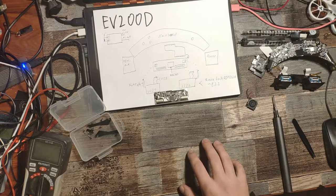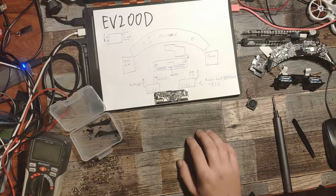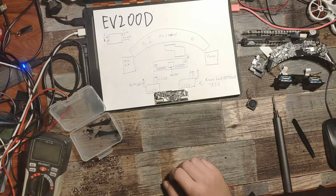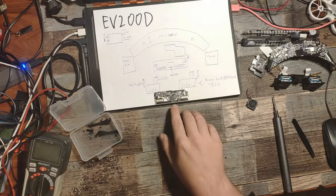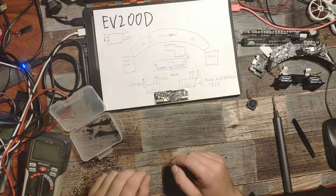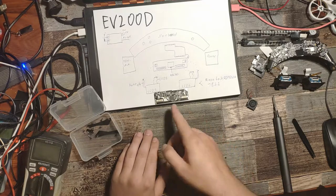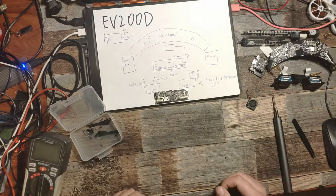But this time not the whole eyepiece was flickering — only the backlight was flickering. So my guess was that the video is working and the BGA must be soldered correctly, because I was guessing the background illumination of the LCD wasn't working from inside the chip but through those driver components on this side. I'm not really sure because I tried to find the datasheet for this chip, but you can only find the datasheet for the next generation — the RDC200 — not the old one. If you find it, please write a comment.